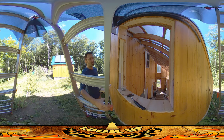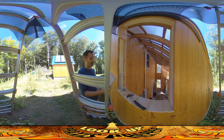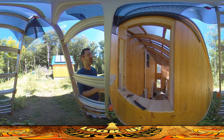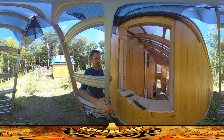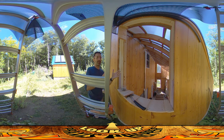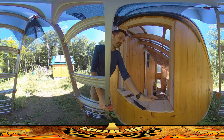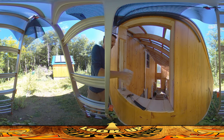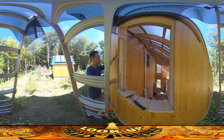Now I could just go and chop that 8-foot board up into these pieces — these are 8-inch pieces — so I could just chop the 8-foot-long board into a bunch of 8-inch-long pieces. But what I'm going to do is something a little different because I don't want to be left with scrap later on. I want to pre-use the scrap that I haven't created yet. So what I'm doing is figuring out exactly what these frames are going to be like, because the frames are going to be made out of this 1x8 as well, and I'm pre-chopping all the pieces I need to the rough dimensions of what the frames are going to be.